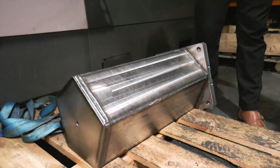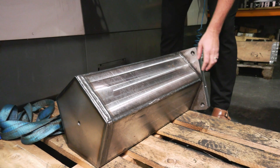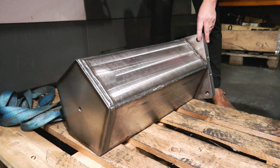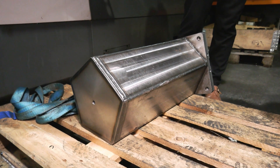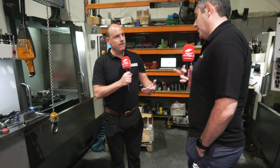Talk me through how you make it from start to finish. We make the plates, which are all designed in-house. The plates are made on the base, we leave a bit of excess material, then they go out for welding. It all gets welded up, sent out for base remachining, then we bolt it to the horizontal and final machine in situ on the horizontal. The plates are made on the verticals around us and then bolted on to carry the products we're going to make. So you put bespoke plates on top — that's right — so we can load different parts across more faces, with the plates bespoke to the product.